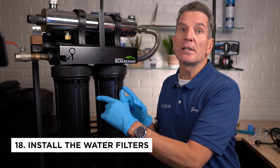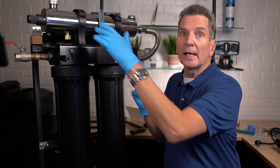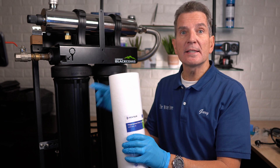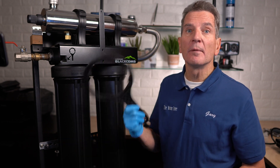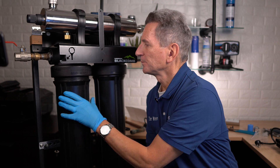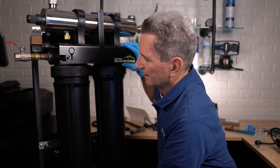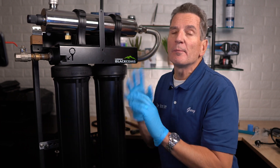Next, you're installing the water filters into the filter housings. As the water flows in, it goes through a sediment filter first, then the carbon filter, and then onto the UV light. For the sediment filter, I recommend a dual gradient filter — 50 microns on the outside, 5 microns on the inside. For the carbon filter, either a 5 or 10 micron carbon filter works fine. Use the filter housing wrench that comes with the system to unscrew the filter housings — lefty-loosey, righty-tighty. Coat the O-ring with a thin layer of plumber's clear silicone grease, pop the filter inside, then tighten hand tight and give a little extra with the wrench just to make sure it doesn't leak. Do the same for the carbon filter housing.